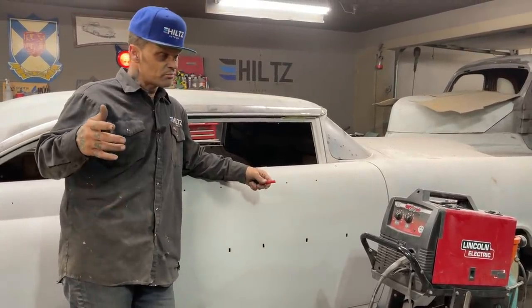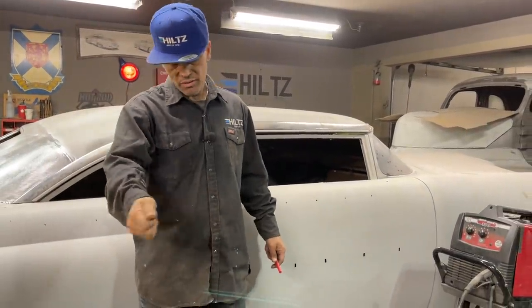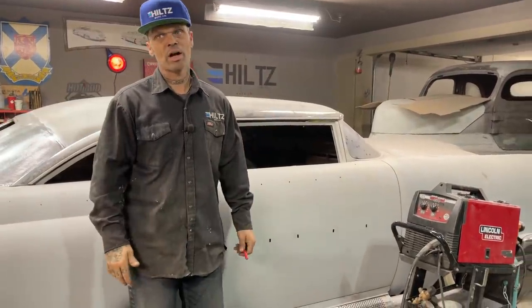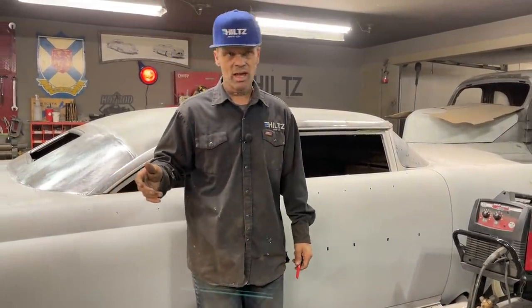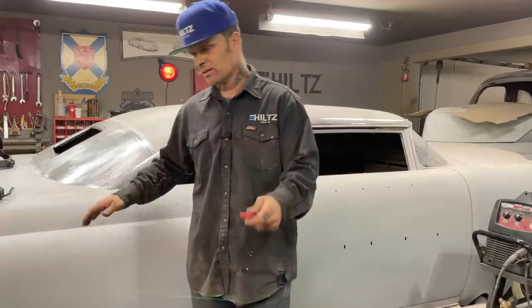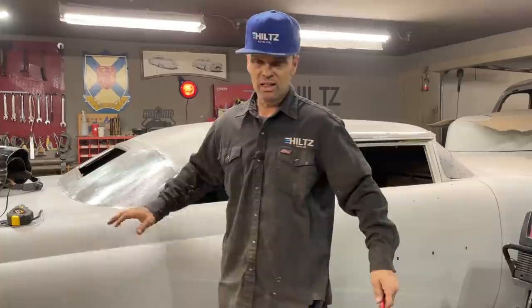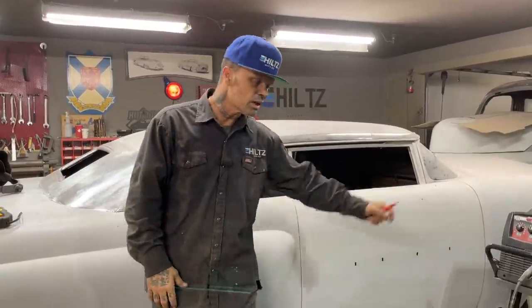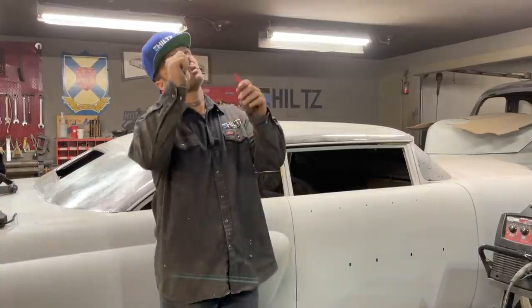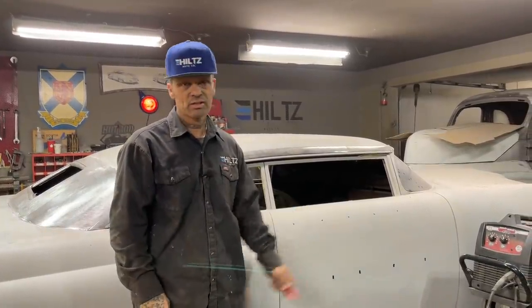So when you're playing with your welder, it's all by ear and by visual, what you're doing. If it's melting off, like I keep saying, that's basically how I do it. Once you get to that stage, you'll know exactly what's going on. A lot of people can listen to me weld and they know if I've got it going too fast, too slow, or whatever. It can be dialed in really good if you want to take the time. I find that sometimes when you're welding underneath, you have to turn that wire speed up a little bit so it's burning good. So that's how I do it.